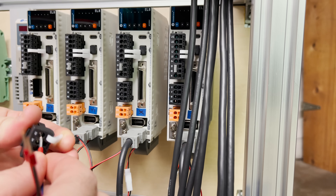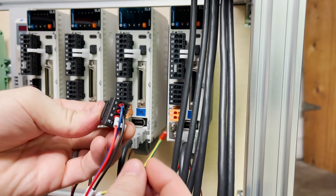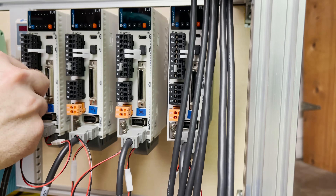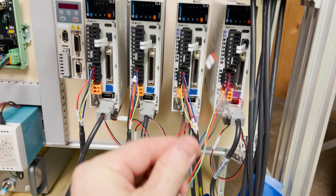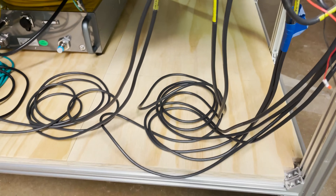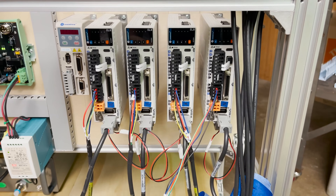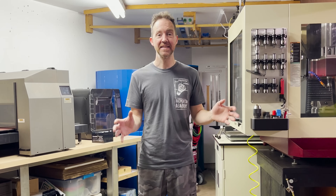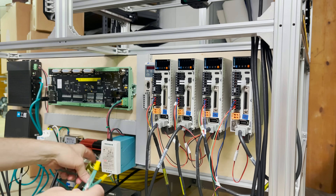I'm going to go ahead and connect all these now. The motors are totally wired up to the drivers. With the exception of the Z axis, I still need to hook 24 volts up to it to release the brake. I wanted to point out I haven't added the contactor for overcurrent protection yet — I reached out to LeadShine support and they recommended what product I should use. I have them on order but they'll take a while to arrive, so I'm moving forward to stay on schedule. I also fashioned a daisy chain to ground all the drives back to my grounding terminal. Just a reminder: I'm not an electrician, just a hobbyist, and we're dealing with dangerous voltage levels, so please consult or hire an electrician to make sure you're doing your wiring properly and safely.